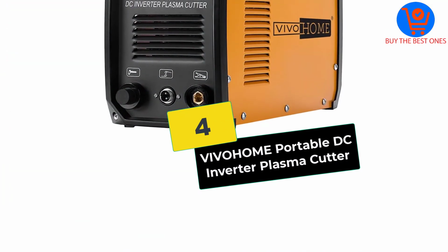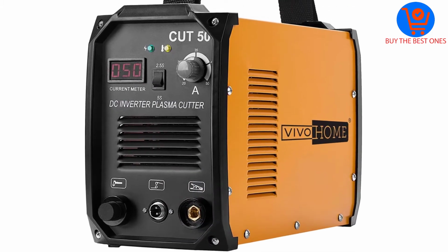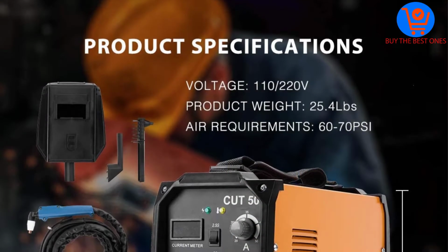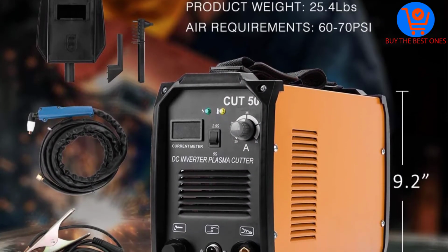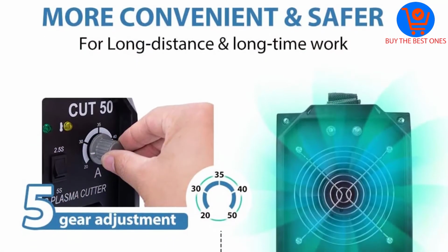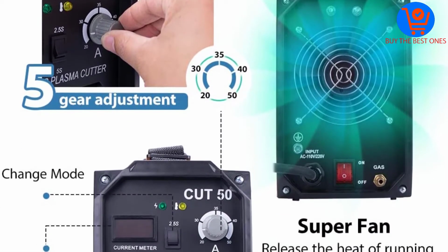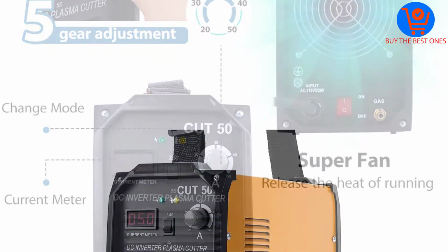Moving on at number 4, we have the VIVOHOME Portable DC Inverter Plasma Cutter. The VIVOHOME Plasma Cutter is another rendition of the inverted tool, with a few useful tweaks. To start, it's adaptable. The unit can be wired to either 110-volt or 220-volt power, and has a switch and dial that can be used in concert to dial in your output current. At full power, the unit has a cutting ability of up to half an inch.